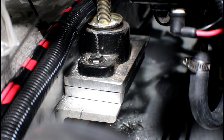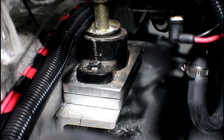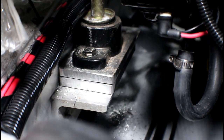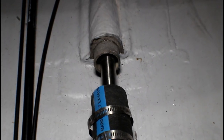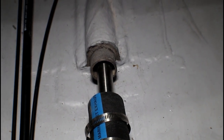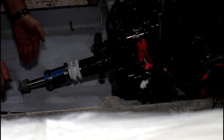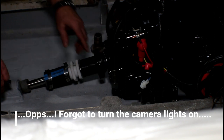You can barely see our front mount. Here's our forward mount with two half inch shim stock bars. I can see all my shavings from the aluminum I had to drill through, and of course we ran longer bolts — we've got to clean up the aluminum. We've got the shaft coming right through the center of the shaft log. Our shaft is coming through the center of the shaft log. I've adjusted the up and down and the rights and the lefts, and secured everything except for the last trunnion pinch-down bolts.